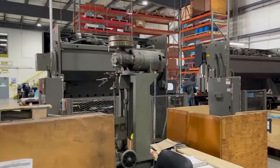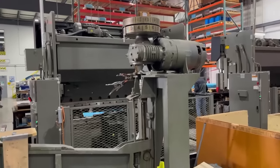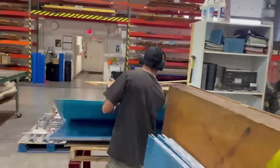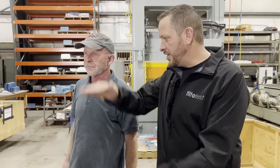They also have brand new technology machines alongside this Farnham rolling machine - a 1940s-era piece of equipment. What it does is put compound curves, big swoopy bends, into sheet metal. Here's a piece of flat sheet metal that's already punched with all the holes going on the machine. It runs a program. People actually take these World War II era machines and add CNC controls to them because they work so well. It can change the pressure and the form - a long sweep and then a sharper one.